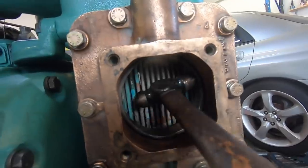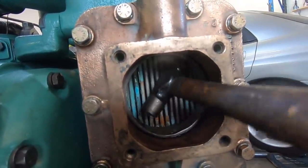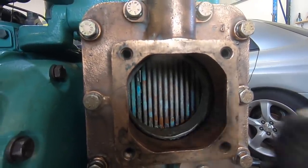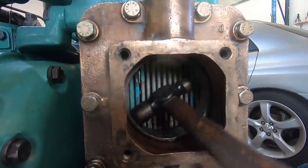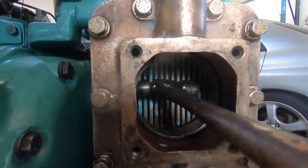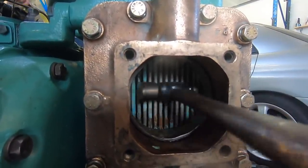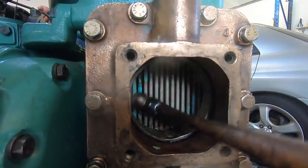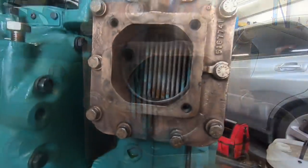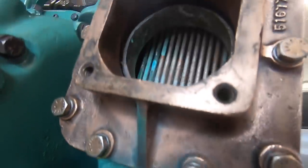It did still leak a small amount though, and Adrian said that's really common. He said what you do is take a really small ball peen hammer, get in there and just start tapping away until the drip stops, just so that you're seating the heat exchanger core against the O-ring, because they get a little bit deformed and the tiniest divot will just allow water to track past. So just little taps around, did that for literally no more than the video you're seeing here, and it never dripped a drop after that. So second piece of good advice.